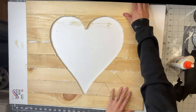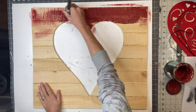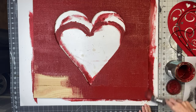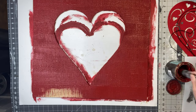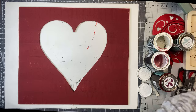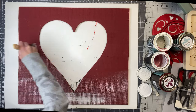This is the back side of my project. Once everything dried, I flipped it back over to the front. Using some Wise Owl Republic Red paint, I painted the entire board. I made the front side the more rough part of the wood. Once that fully dried, I took some Wise Owl Snow Owl and I just did a light brushing on top of the red.